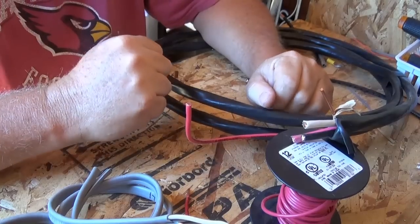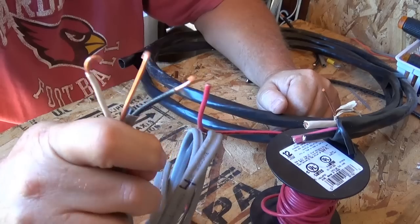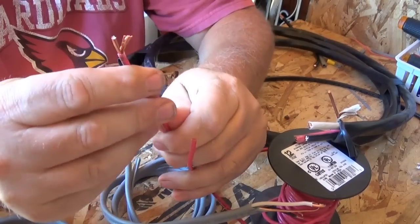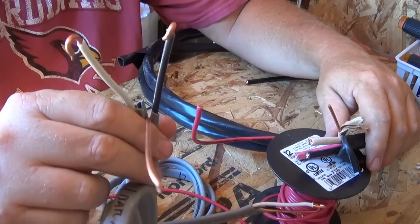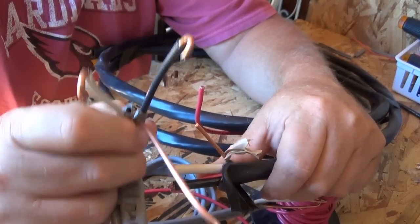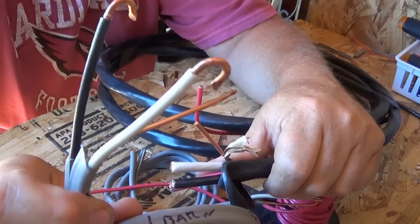So now it's time to get amped up over these wires. Let's briefly take a look at the difference. I have solid wires and stranded wire — meaning there's a whole bunch of strands in there. Then I have one wire here but there's three including the ground, and then there's four in that one. This is considered 12 gauge and this is 6 gauge. This is a 12/2 and this is a 6/3.